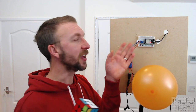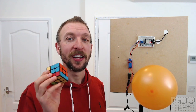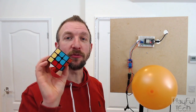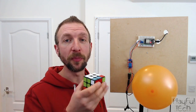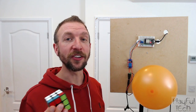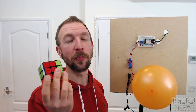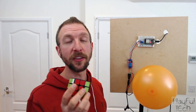On the board behind me I've got an ESP32, and that's actually the only piece of hardware you need to make this work. I'm using an ESP32 rather than an Arduino because the Rubik's Cube broadcasts over Bluetooth, and the ESP32 has Bluetooth built in. Common Arduino modules like the HC-05 only support Bluetooth Classic (2.0), but this cube uses Bluetooth Low Energy (4.0), which the ESP32 supports.